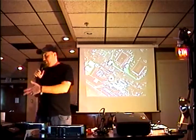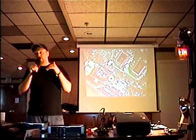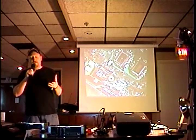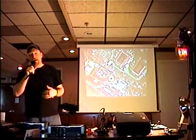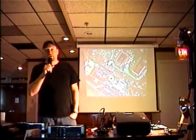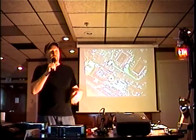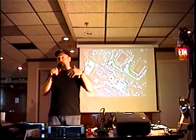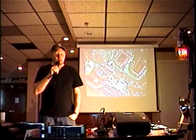Put your new hard drive in, boot from the CD, prepare the drive, format the drive. It creates all your partitions. It will write basically a factory C partition in it that has the Xbox Live dashboard on it. And there's also options on the auto installer CD for installing applications. It comes with a lot of applications and it saves you a lot of time. Basically what I do is I prepare my drive, I install the dashboards and lots of applications. We'll talk about the different applications later.